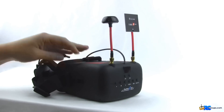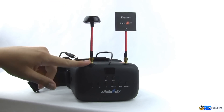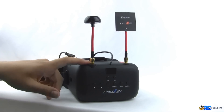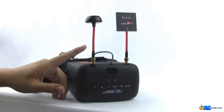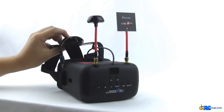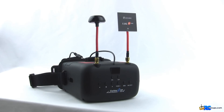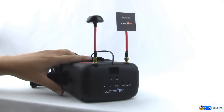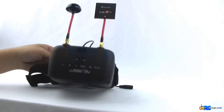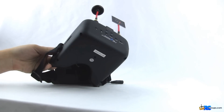Other than diversity and DVR, I want to note that these antennas use RPSMA connectors, which is not your typical connector, so if you plan on swapping them out just be aware of that. The unit also has a built-in battery voltage detector — if it drops below 7 volts it'll start beeping. One thing to note: there is no AV in or out anywhere on here, so you can't plug this into an external monitor.